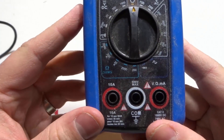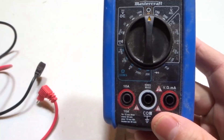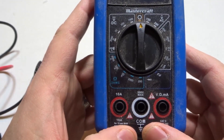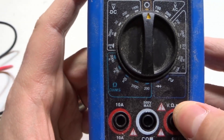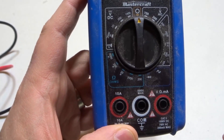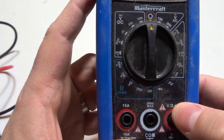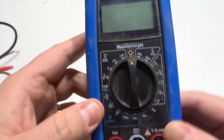You can see on your multimeter you're going to have more than likely three ports — some multimeters even have an additional port. The ones you want to use are the common one, which says COM for common, and then the one that shows the symbol for ohms, also known as omega. That little omega symbol is also labeled 'ohms' right on the multimeter.